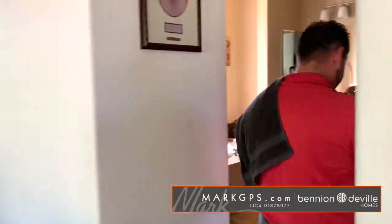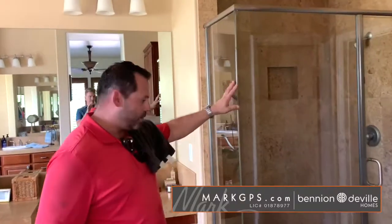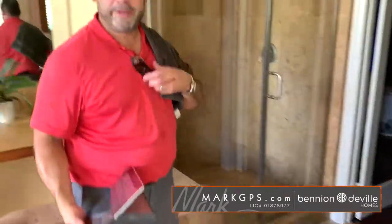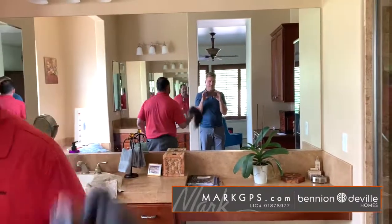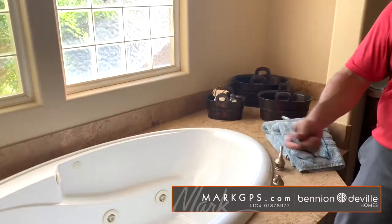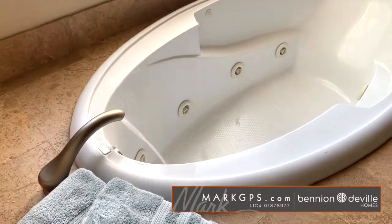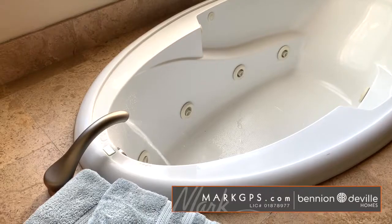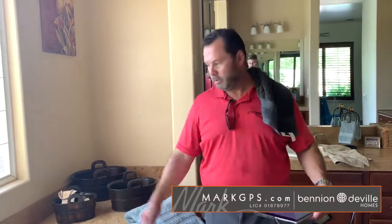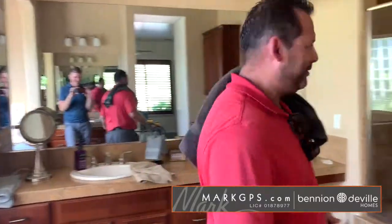In the master bathroom, when the shower head is hitting against the glass walls, there's a little bit of leaking in two spots — I'll identify those with circles in the photos. That just needs clear silicone caulking. I also recommend getting a faucet with a larger gallons-per-minute flow rate, because it took 22 minutes to fill the tub above the jets just to test it. A wider diameter spout would allow more water flow, otherwise the water would be cold by the time the tub is full.